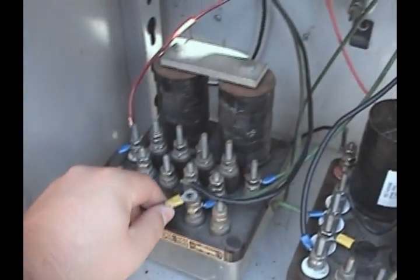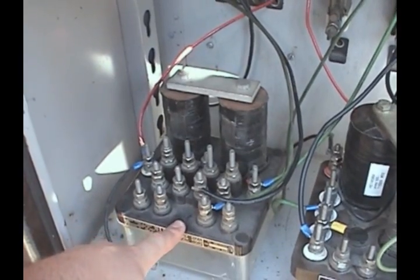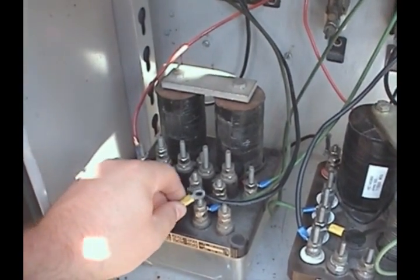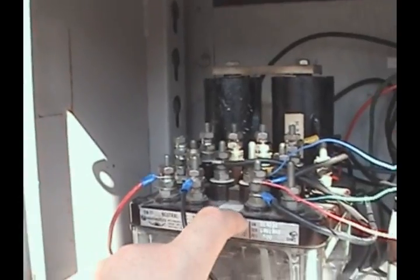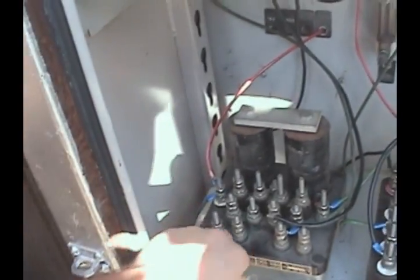That signal still has to be hooked up too — that's the wire going up the fence there. In here I have a test cable to manually activate it. What it does is it picks up this relay, causing the XR to drop, and then drops this one as well, and this one. But this one is a slow drop, so it doesn't drop until after about three to four seconds. So here we go, I'll do a test run of that.